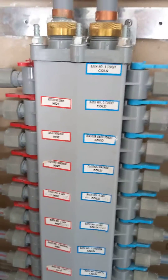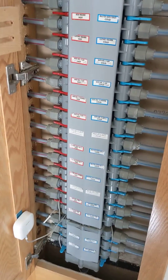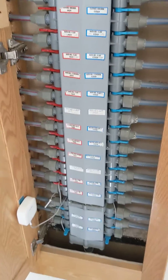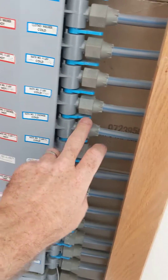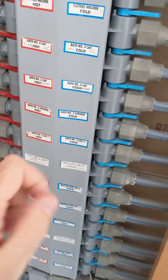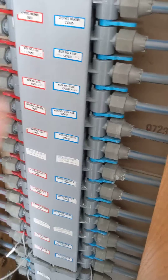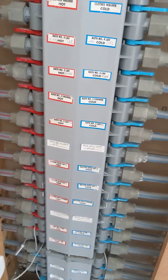It's a good idea and concept but these things leak really bad. We live in Las Vegas, Nevada. Tons of houses built over the last few decades have got these, and every plumber gives the same advice: never touch any of these levers because they break really easy and often start leaking. So the best advice is never touch it. Just use your main shutoff if you ever need to.